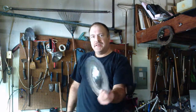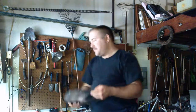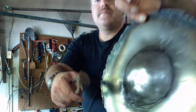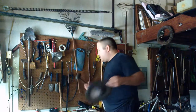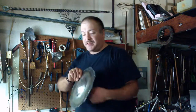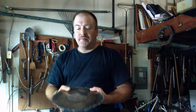You can see it's a fairly thick steel plate. It makes a nice sound when you hit it. What I was doing was simply cold working it using the ball peen to give it the boss. I may not be able to give it the deepest boss in the world, so I may have to have a handle that kind of bows out a little. But I am going to keep working at it more, try to give it more of the boss.